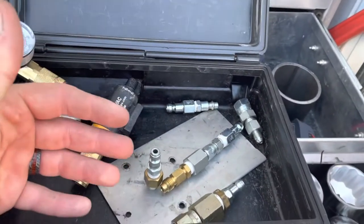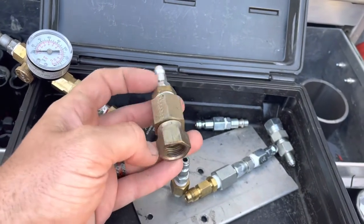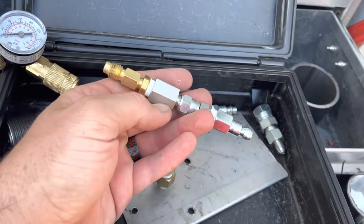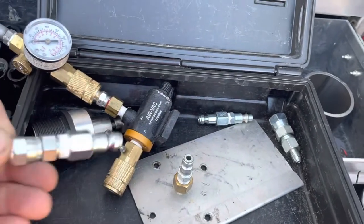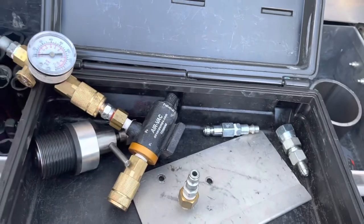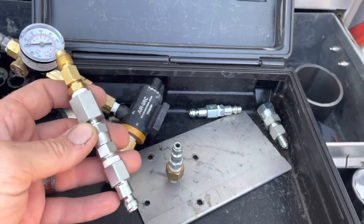There are all kinds of little attachments — just stuff you put together. This one's for a John Deere wheel loader: you take the hydraulic tank breather off and this couples onto there. This one is for AC — I actually used this one today. You hook it to your manifold gauges and this air chuck chucks into there. I use this to pull a vacuum on an AC system. I'm going to do a video on how I do AC using this tool with the gauges. That's another thing I use this for: vacuuming down AC systems.